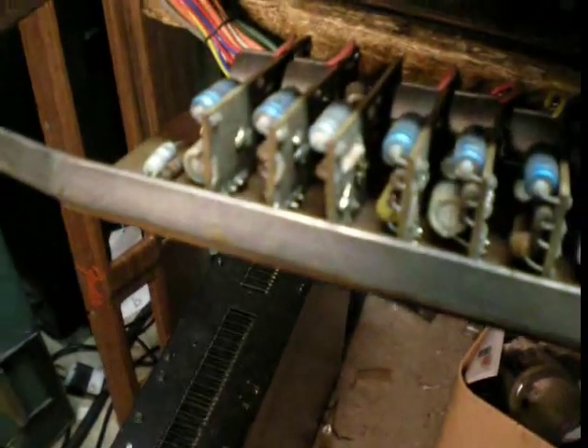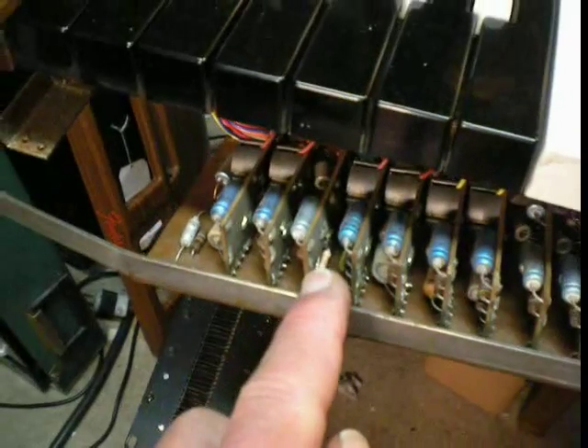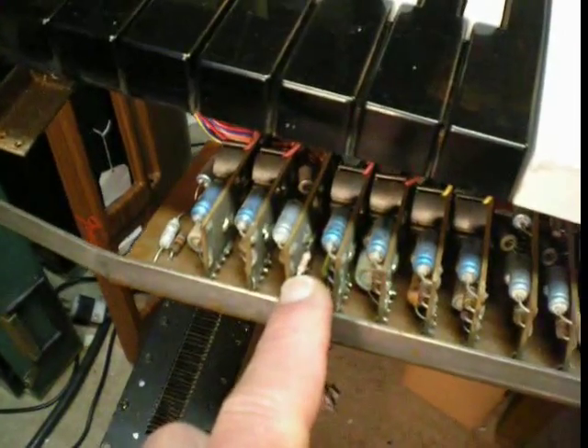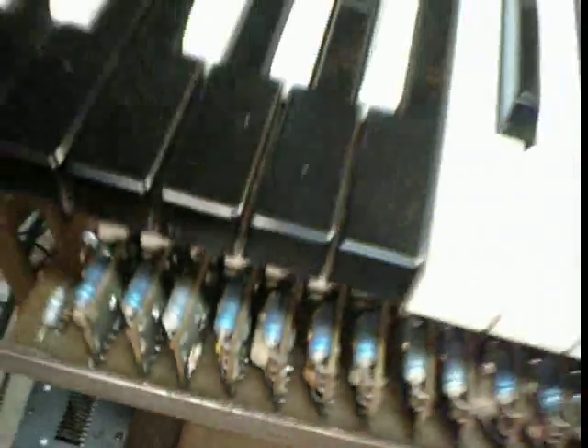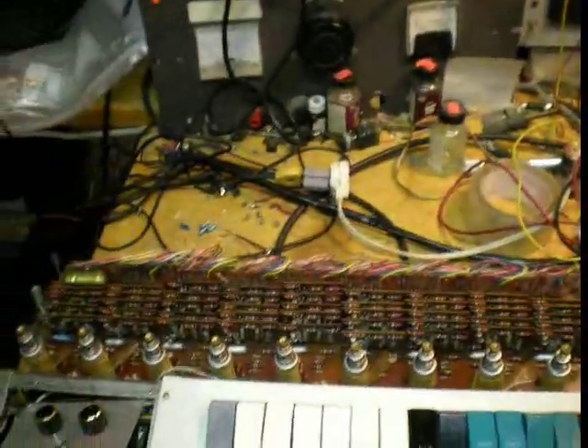Can you see the resistor? Third card over — right there is a resistor, the one on the bottom in front. I paralleled it with a 12-kilohm resistor to get a little more bass. Now it's a little more balanced. That was a pretty weak bass — it may have a bad electrolytic and I'm just not finding it. I checked the ESR on all of those and they seem good, so I'm just going to put that little mod on it and call it good for now.